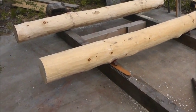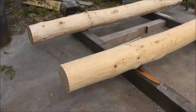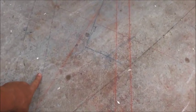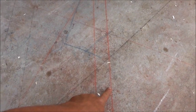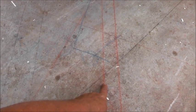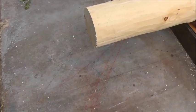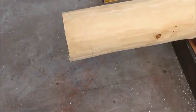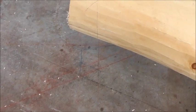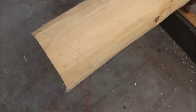What we've done here is laid out the truss on the concrete pad — all the joinery — taking into account the different sizes of the material. You can see this is the top line of the rafter. This represents the bottom line, which is 12 inches away. This is a 2-inch bearing line for inside the collar. And then this is the joinery where it's going to scribe in. This whole process is called lofting — all the lines are laid out on the floor and then chased up with levels or some sort of plumb line for each reference line.